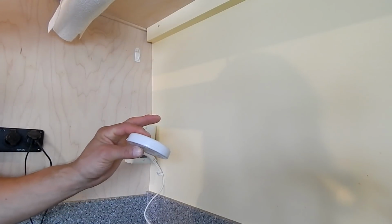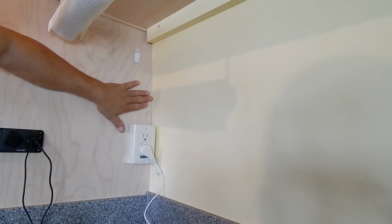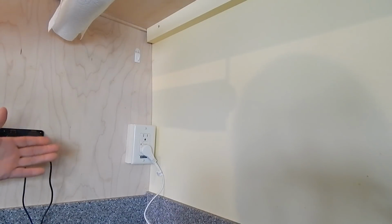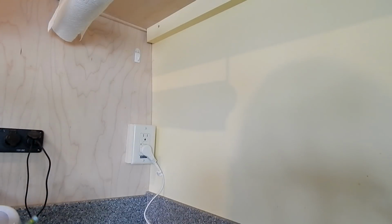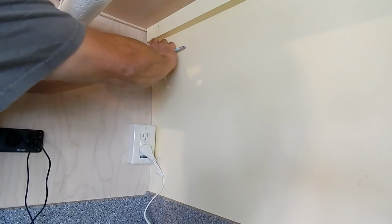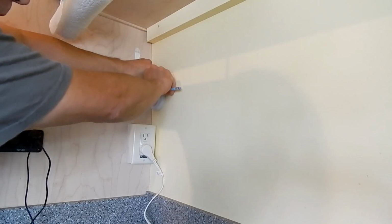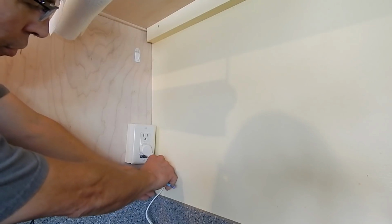Now, when scribing, let's pretend like this is a block of wood, and I would suggest to get a block of wood, and this pencil would be sharp. So this would be a template, the actual template. Now, it has to be held in place square off the floor, because remember, the floors are a reference. So I highly recommend for this process to have 2 people doing this, because it'll make it go a lot easier, where one person can be responsible for making sure the template is square. And the other person will take this block of wood and a pencil and run the pencil right down the wall. And none of this stuff would be in the way. It would just be straight down, where you would just run it straight down and you get a mark.